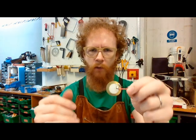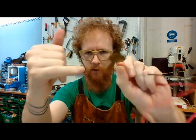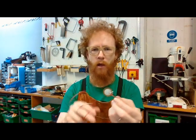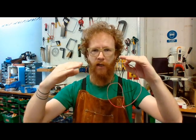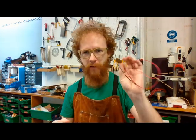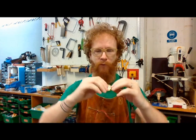This is a slightly bigger one which has been wired up. There's a solder joint on the ceramic disc and a solder joint on the conductive disc. So when this one is put under any kind of strain or any kind of movement, or when these two things move against each other, it will create an alternating current in the same shape as that stress, that strain.